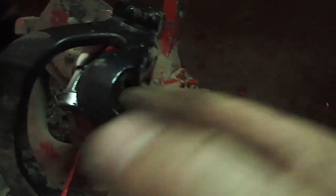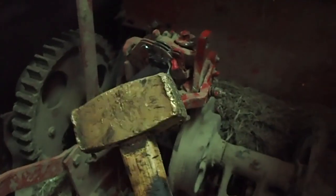The fourth and final pain in the ass is actually the knife arm. The knife arm is to gently touch the bill hook. This is the bill hook keeper right here, and it has a little spring tensioner. I like to have it fairly tight — in your operator's manual it has the poundage that it's supposed to be, but a quarter inch of thread on that is usually pretty good. I have replaced these springs before on the old baler but never on this one.